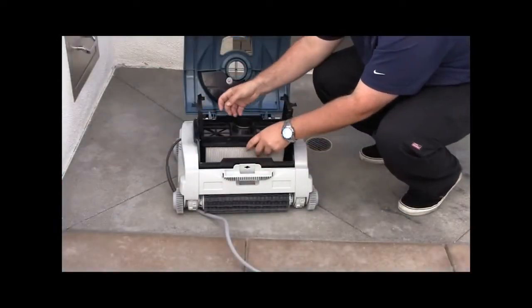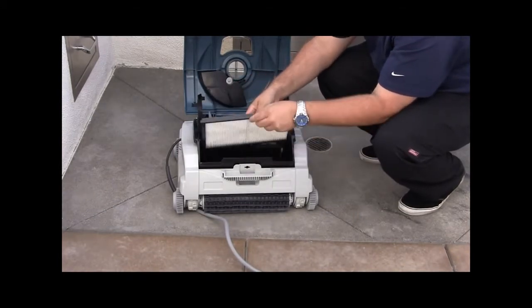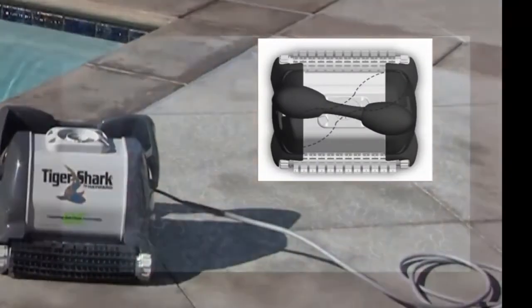Verify there is no other debris inside the cleaner body. Remove the cartridges and cartridge assembly to look inside the body of the cleaner. Verify that there isn't an excessive amount of bubbles on the cleaner. This would indicate small bubbles entering the pool from a small suction leak or ozone system. These small bubbles, along with other symptoms, can cause the unit to float. Verify the handle is in the proper position.